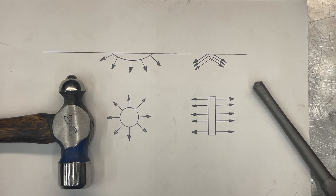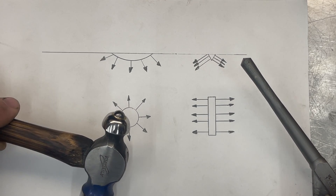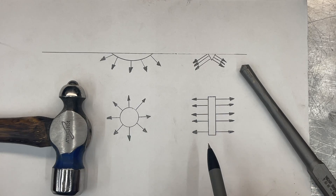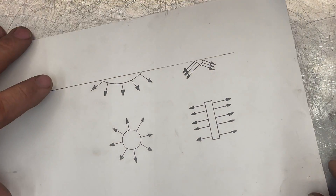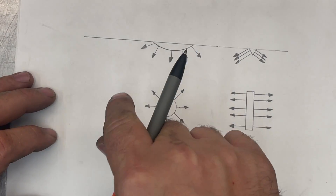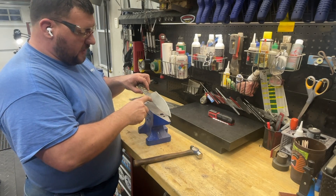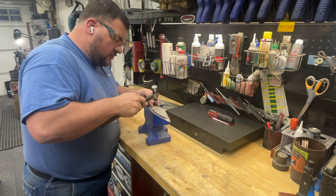So I tried to draw up a little schematic here. These are your two most popular types of carbide straightening implements — a chisel type and a rounded ball type. With the chisel type, there's a lot more stress put in there with the sharper notch, but you get a lot more uniform direction. If you hit it straight, it pushes the material this way; if you angle it, it pushes it in that direction. With the ball, it stretches the material in all directions — as you deform that material down, it's got to go somewhere so it pushes it out. So we're going to do a little bit of line straightening on each side to force more material this way and straighten out this banana shape.